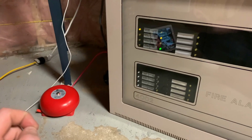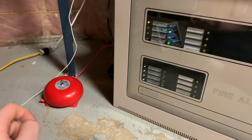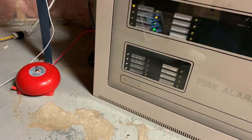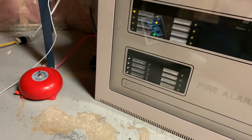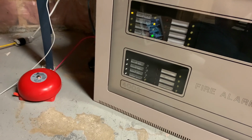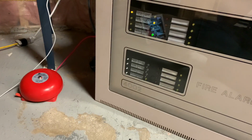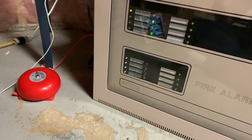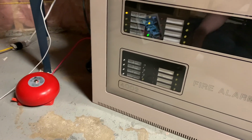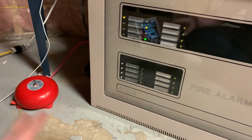But these panels actually have a weird quirk with them where when I used it, it powered for about 2 seconds, then shut off. The horn shut off, the light continued to go. But it actually damaged my 9838, or one of them. I have a few. But it sort of damaged it because when I tried powering it off the panel, the horn was barely working, the mechanism. What it turned out to be was that these metal pieces that hold the vibration part in place somehow bent forward when it happened. So I just bent them back, and now it works. It's slightly lower pitched, but it's still smooth. It works perfectly fine now.